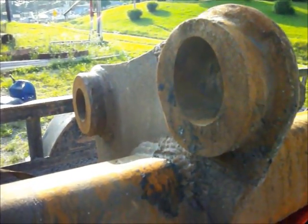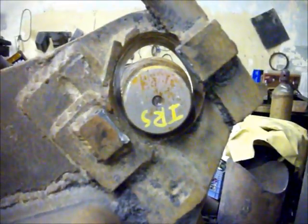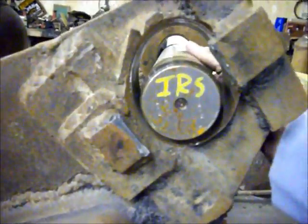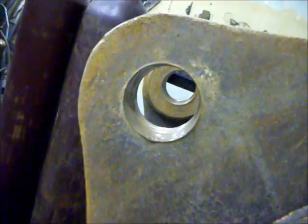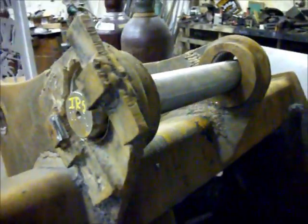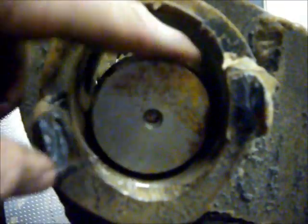Here's the pin that's supposed to fit in that hole. I don't know why it's got that wear on there but that kind of makes me nervous. This one's wore out, not near as bad as this one up here though. The other side's all worn out too — damn. I've got to fill all of this up here; it's going to make it hard to line up.